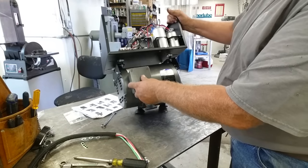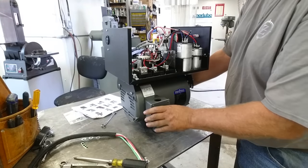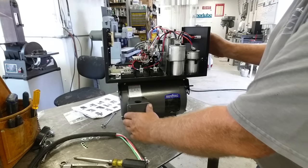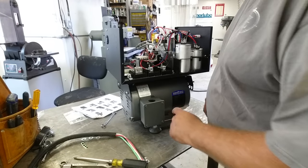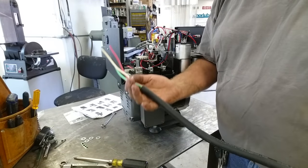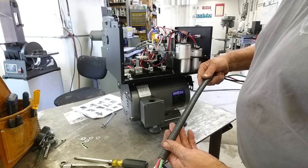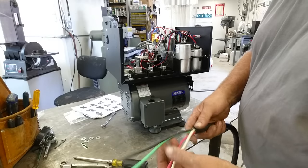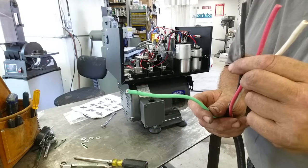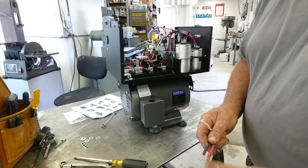Our mounts are done. The upper box is wiggling independently from the base, so the whole thing has a nice flex to it — no worrying about damaging electronics. Now we need to get from the pecker head of the motor up to the terminals. They've supplied a number 10 AWG four-conductor cord. We'll use green for ground — that's the national standard — black for phase A, red for phase B, and white for phase C.